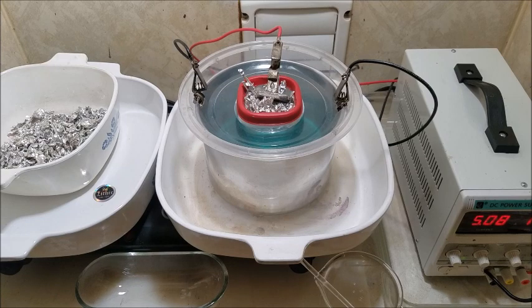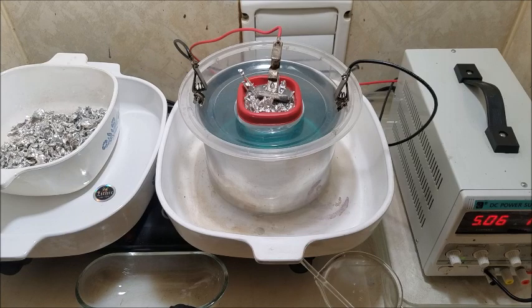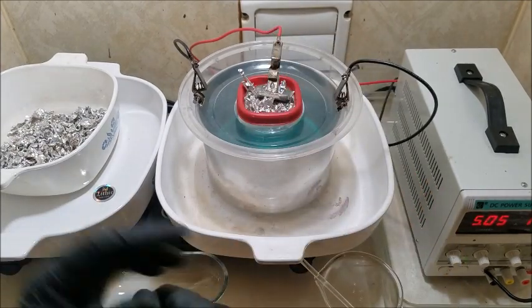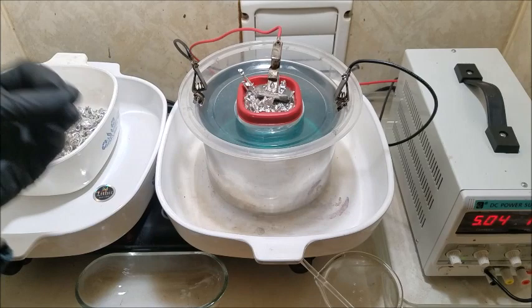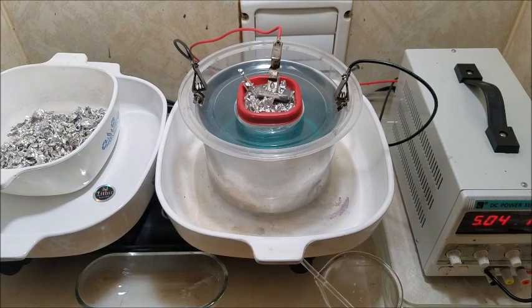I'll be checking on it periodically every few hours, just to make sure, because when the electrolyte does start to fail, the crystal growth gets wispy, almost like strands of a Brillo pad, the steel wool. So you want to avoid that, because that stuff grows like vines up towards your anode, makes it to the basket, grows through the basket or through the filter, touches and makes a connection with the silver, and boom, you just popped a fuse. You just burned a hole through your bag. Whatever slime is in your filter can leak through. I have had that happen, but I haven't had a big burn hole where the stuff just poured out. But whatever, you got to toss it and start over again. So we'd like to avoid that.